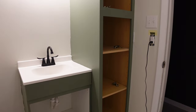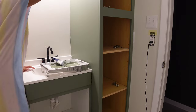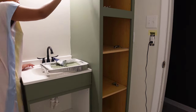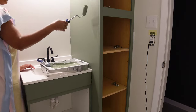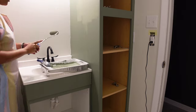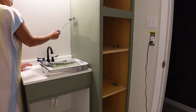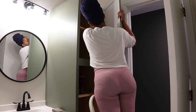All right, so this is the footage for the next day, and it looks really good. There were only a couple of spots I needed to go back and touch up, but I decided to go ahead and do an entire third coat on both cabinets. So this is the third and last coat. But we are not finished just yet — I do want to seal all this paint up. When I painted my kitchen cabinets, I noticed that about three or four months in they started to fade, peel, and scratch away. We are a very active family — three children, a husband, I cook almost every day. To seal in the paint, I'm going to do a top coat using a clear satin finish polyurethane, which you apply and allow to cure and dry for at least two days.